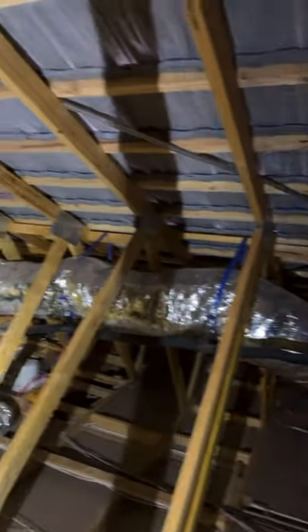As I'm going in under those ducts, I did find something — there's the insulation. Those supports are all inadequate and those insulation bags have to be installed. This is a handover inspection — don't forget that. Let's keep digging in. This duct goes nowhere.